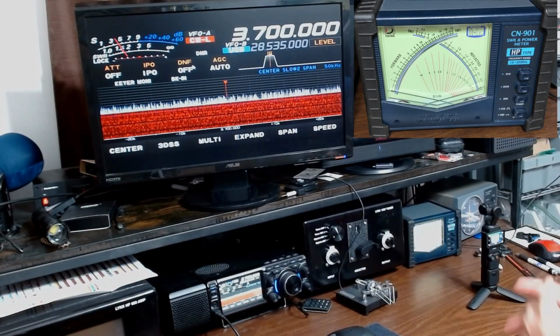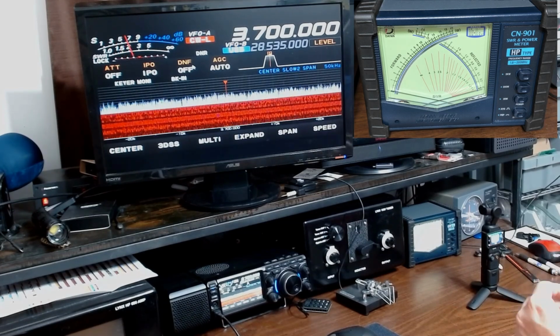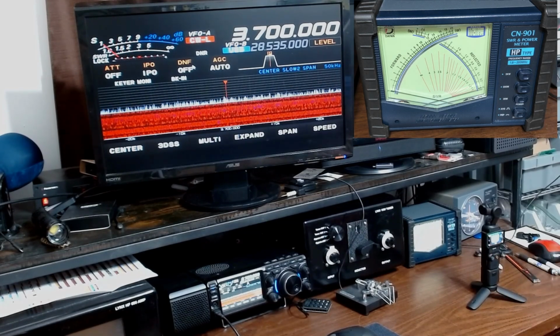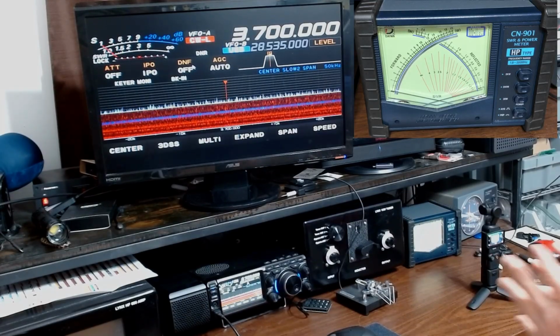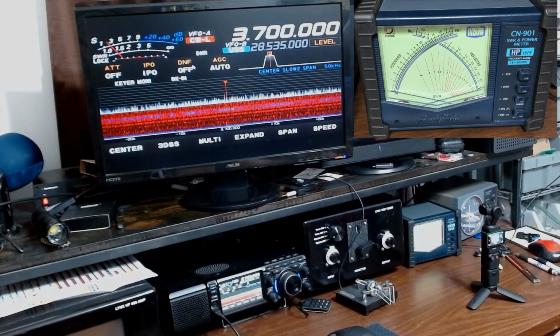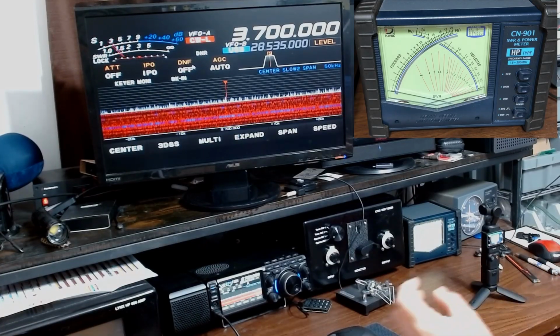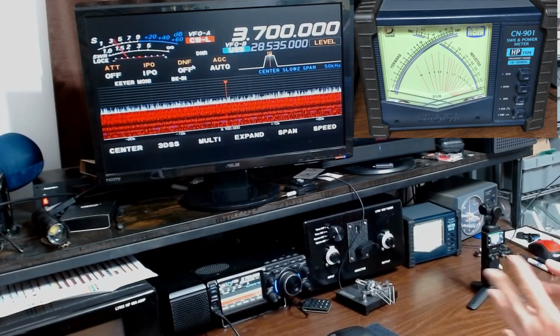So I hope that kind of puts it to rest that your antenna is not being changed. You have not changed the mismatch at your antenna and your feed line. It's still mismatched. You still have everything going on you did without the antenna tuner, except your radio can effectively put power out now. And there's no harm to your radio. Nothing. Your radio has no idea. It believes your antenna is a perfectly tuned antenna.